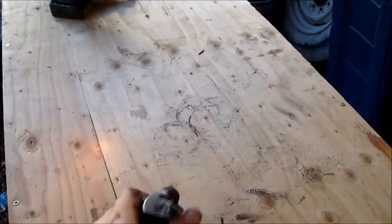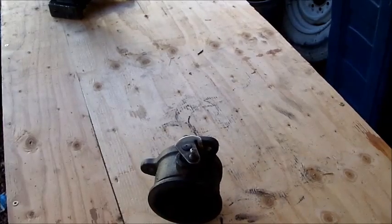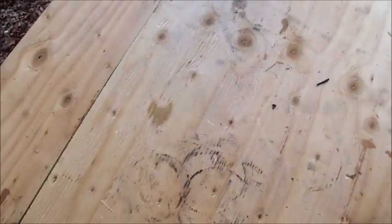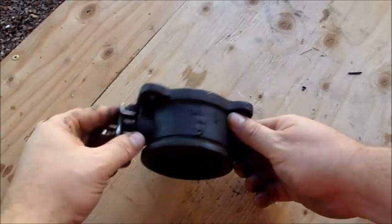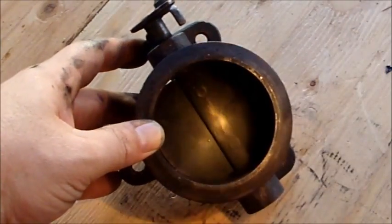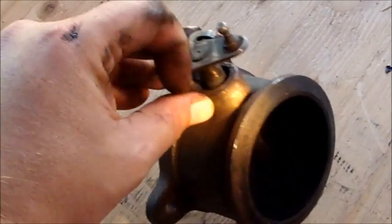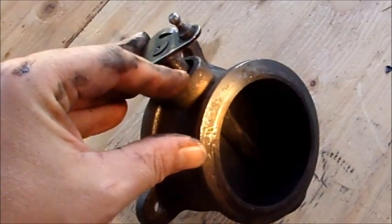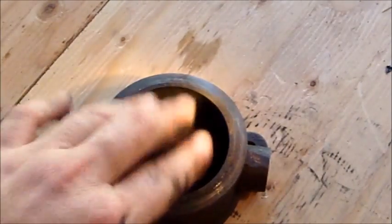The whole assembly right here on the top is going to slide right out, and it's pretty basic after that. After you remove these two rivets off the inside, the plate comes off, and this assembly slides right out the top. You put a three-quarter inch freeze plug right there at the top, and I'm going to use some high temp RTV silicone when I cram it in there. That'll remove the fin from here.